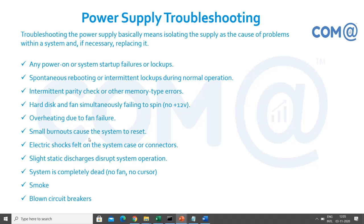That may be because of a virus, but before going to that, you have to ensure your SMPS is giving a proper power supply and there is no short circuit. You can check it using your multimeter, or you can check the power good signal. Test the orange wire and the black wire. You should get +5 volts. Otherwise, you have to change the SMPS.